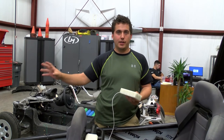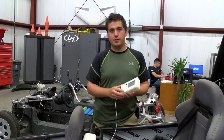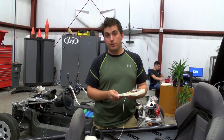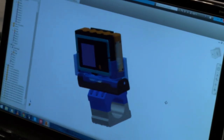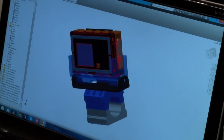So that you can get some real-time data feedback. We're going to be recording GPS position, accelerometer data, gyroscope data, as well as connecting via Bluetooth to handheld devices, with the intent of getting a baseline of what we need — things like the resolution of the accelerometer or the refresh rate of our sensors — for the final version.